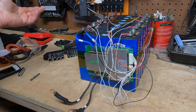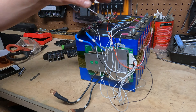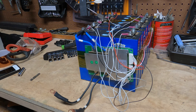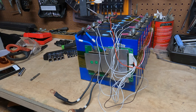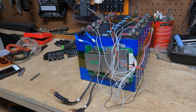This BMS can do 100 amps out. From here I'd suggest putting it in some sort of box — you can build a box, use a portable tool box, a tote, whatever you want. I'm going to be building a solar generator and this will be the battery for that. That's it — you've built yourself a battery. Clean up these wires with a zip tie or something. See how easy it is to build a 24 volt lithium iron phosphate battery out of 3.2 volt prismatic cells. Leave a comment below if you have questions, like, share, subscribe, and I'll see you on part two when I build my solar generator.